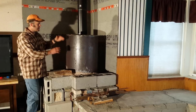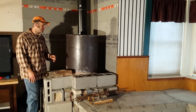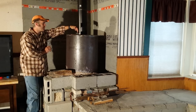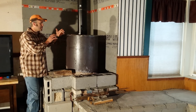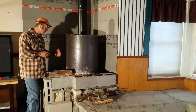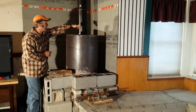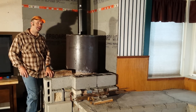It's coming up, and it's not just 8 inches — I've got a 16-inch pipe around that, insulated with a perlite and fire clay mixture. What that does is it allows it to create a vacuum, and as this burns, the heat transfer sucks air into this so fast. We've got excess extreme heat right there in the pipe. In the center it is the hottest — it's burning — and what that's doing is it's burning all the creosote out of the smoke. It's called the secondary re-burn.